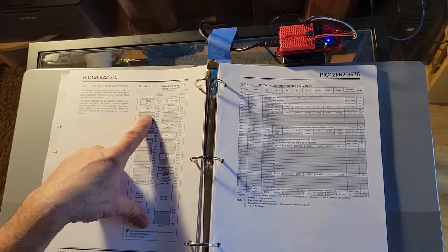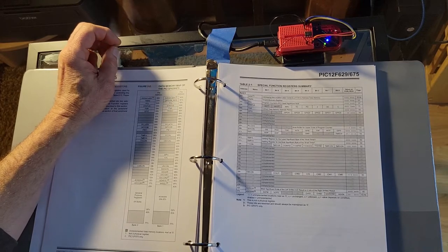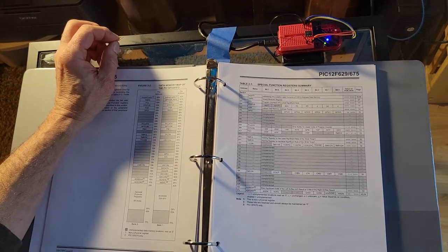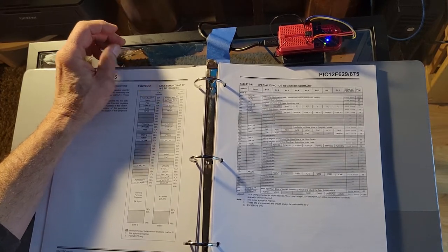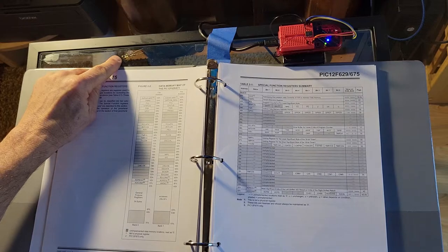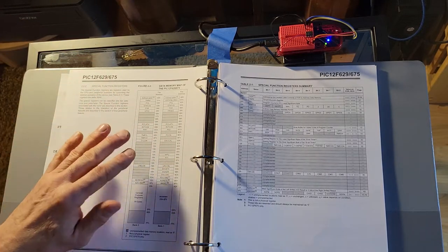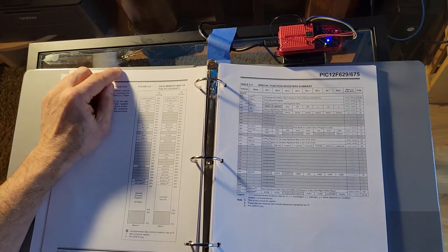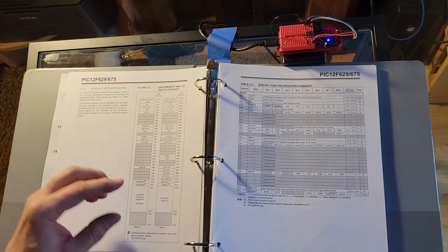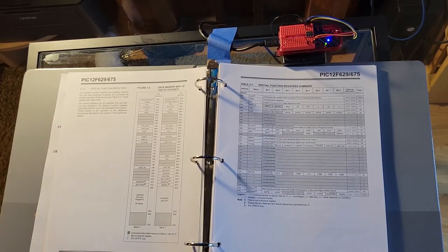I will also do a delay between on and offs, because these little microcontrollers run quite fast in comparison to the real world. Not so fast compared to a full-blown computer like a laptop, but they run pretty fast. This will be doing about a million instructions per second, which means when I request it to throw a high onto that LED, it does that in a millionth of a second, and then a low turns it off within a millionth of a second. If I just did a steady on and off, it'd be so fast you would not see it — it'd be a blur. So I'm going to create a delay using a nested loop with some registers in the general purpose registers, creating maybe a quarter or half a second of time delay between the highs and lows.